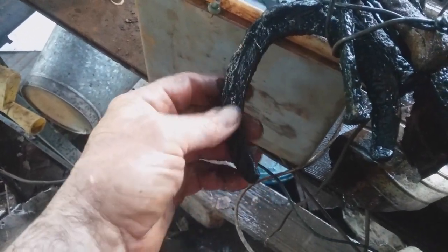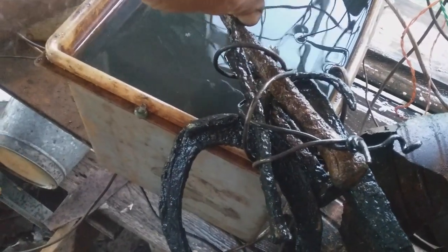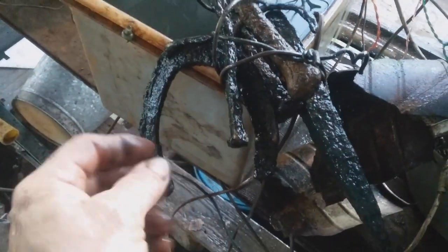It will kind of deposit itself on the good iron and push the rust away from the object. So next time you use your hammer to clean that object you'll see the rust will flake off much more easily. In the process there will be oxidation — your object will get black. Every time you take it out and hit it a little bit, the rust will flake off easily, losing its bonding with the good metal inside.